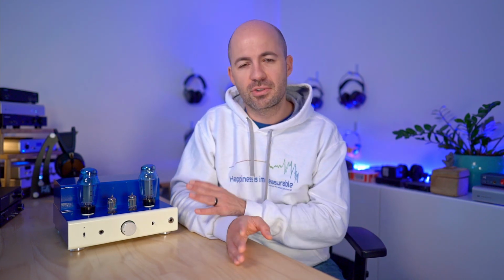With that whoopsie out of the way, let's now talk about some capacitor upgrades that I think might have made subtle but positive improvements. Now, normally when making modifications to circuits like this, it's beneficial and recommended to do one modification at a time. That allows you to first of all hear what's different after you've made the changes, but also troubleshoot issues more easily.